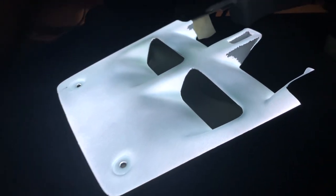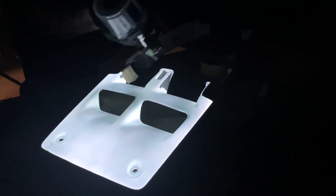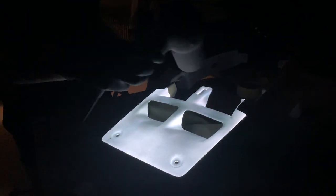You'll also notice on this side there's a little spot where it's not lighting — that's because no conductive top coat has gotten there. That's where you come in, agitate the gun, and apply just a tiny bit — boom, they disappear. It only takes that tiny little bit and then you dry it.